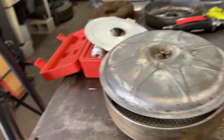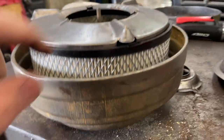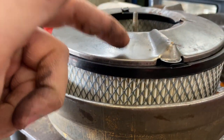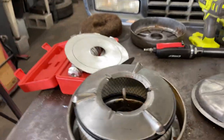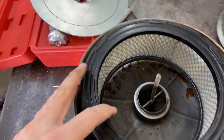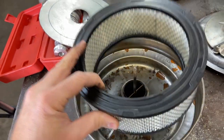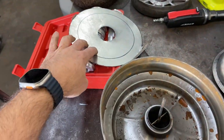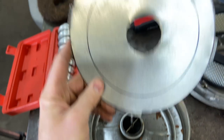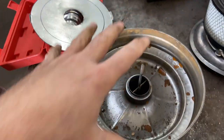Plenty of room for the wing nuts, plenty of room to breathe. Lid comes off. We're going to use this cap. The only issue I have are these little gaps right here, but I'm going to put some foam on the inside of this just to seal it on top of the filter so that we're not sucking in unfiltered air. The filter sits in here — it's just small enough that it moves, so I want to use these little tabs that I bent on this plate, or I'll put something along the perimeter to keep the filter centered.